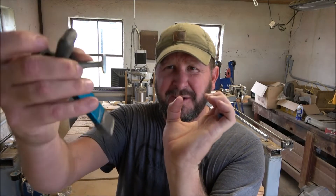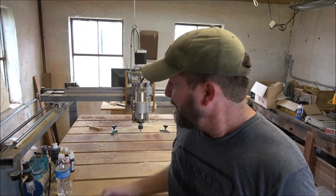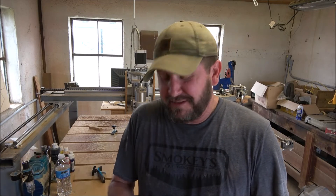The next question I get asked is about my clamping system and if I'm happy with it. I am fairly happy with it. I use T-Track, which is just track made of aluminum — a little thing on one of the clamps slides into it and goes underneath the lips, and whenever I tighten it down it pulls against it and holds good and tight. There are several different ways to clamp things down: compression clamps that come in from the sides, and also wood clamps that wedge in and put a downward pressure. This is the way I just started, and I'm happy with this system. It was really pretty cheap — I ordered all of it off Amazon. There may be links below my videos on it, and check it out because this has worked well to this point.